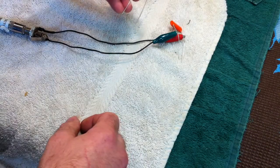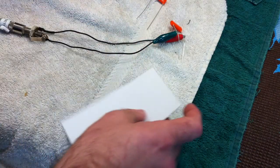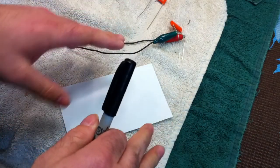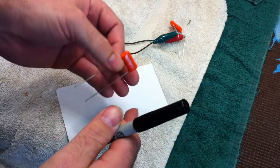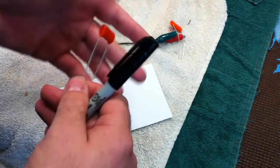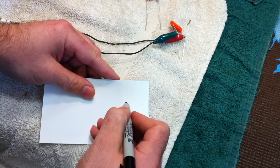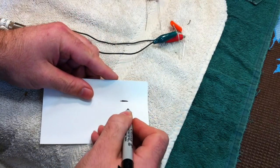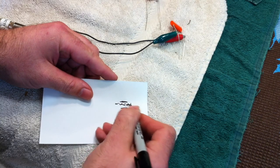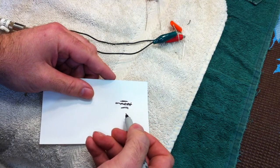Let's talk a little bit about how capacitors work in general. Capacitors that aren't electrolytic — the kind that you would typically see in a guitar, like monolithic capacitors or disc capacitors or orange drops — work pretty much on the same principle, which is that you have a conductor and another conductor, and in between these two conductors you have some dielectric material, which is a non-conductive material.